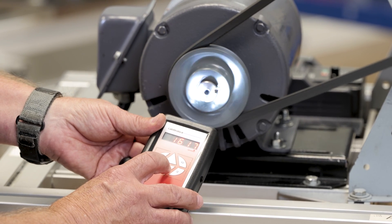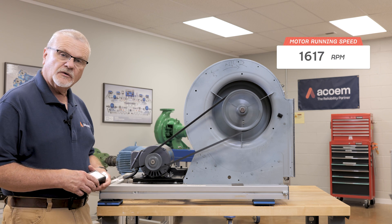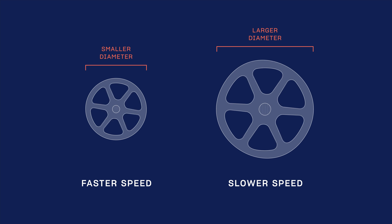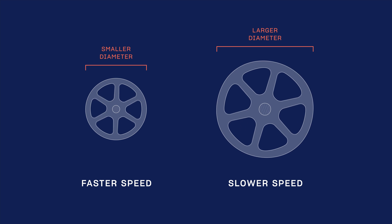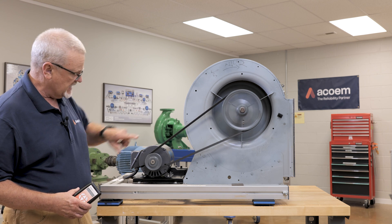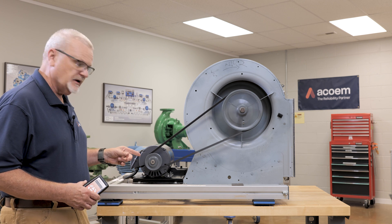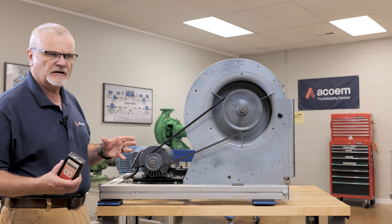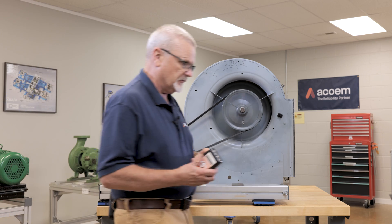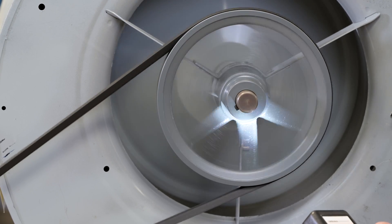You just want to lock it in until you get a steady speed. We've tacked in our motor speed at 1617 RPM. We may well want to know the fan speed as well. The smaller the diameter, the faster the speed — so going to a larger diameter sheave, I know it's going to be running slower. I'd guess this is about three times the diameter of the motor sheave, so the speed should be roughly one third — about 550 RPM. We're going to start out at about 550 and see how close we are to the running speed on our fan.